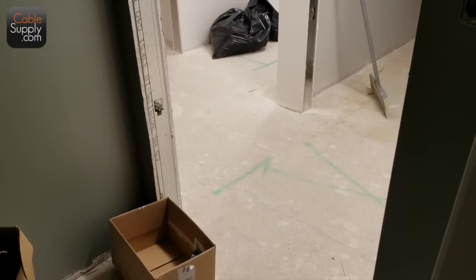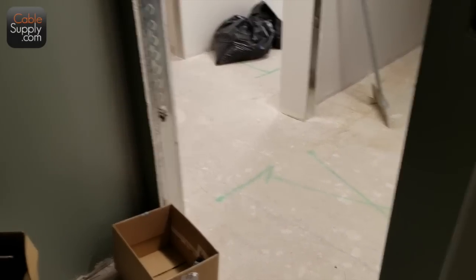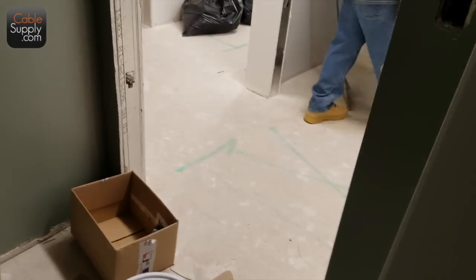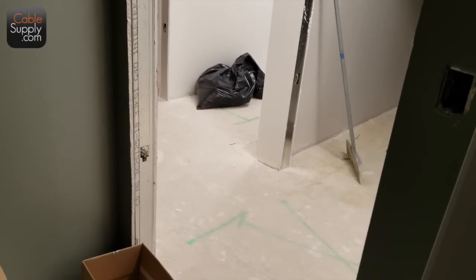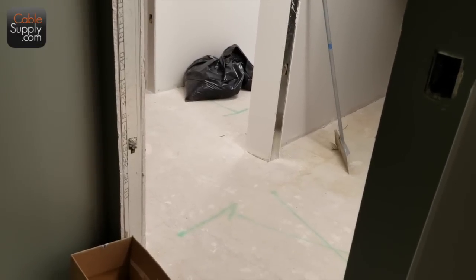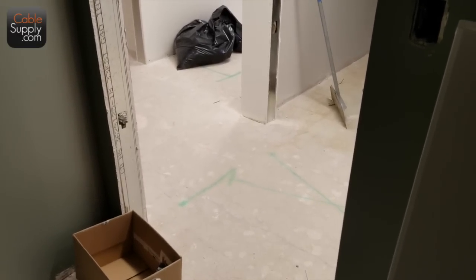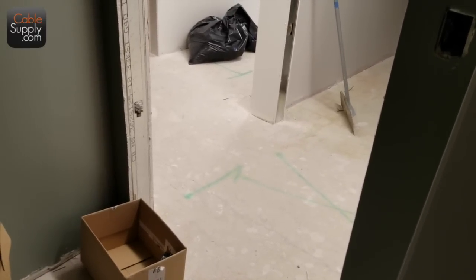Most likely I can get the jack in that area, but sometimes it's going to be three feet to the right or left because of the wall. The only time you really need to get in there before the drywall is those pony walls — those half walls. You've got to have conduit in there or you're going to have to cable it before you put the drywall in, and it becomes a problem. Houses are terrible. Try to avoid residential. You are a good cabler if you do houses, because houses take five times longer.